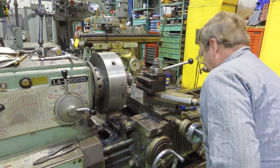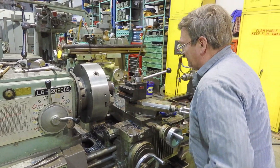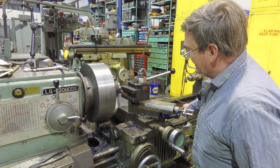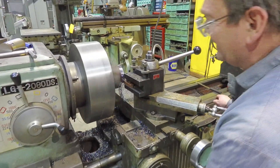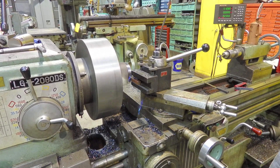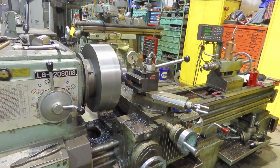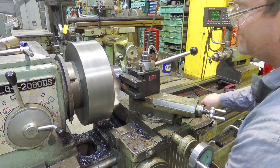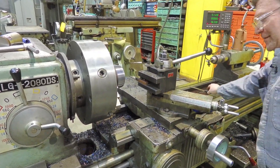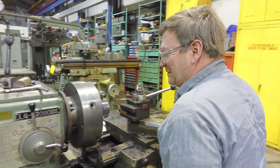Let's try reducing depth — that will be the next one. Now we're getting some little breaks. That's breaking because it's inconsistent surface there. I turned the feed rate way up, still not quite breaking the way I want to. And I know many of you are out there saying 'put a chip breaker in it.' Putting a chip breaker in it helps a lot. But I want to talk about how you can play with some of this before you put a chip breaker in it.